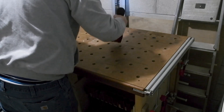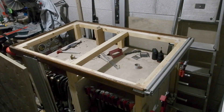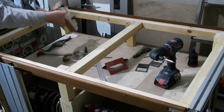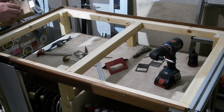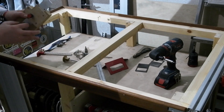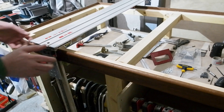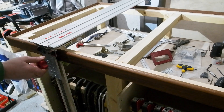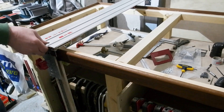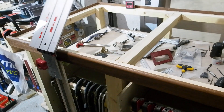Moving on — good a time as any to whip the top off. Then I can remove the front pin assembly to receive its own makeover. It was while considering my options for this that I discovered the perfect star knob for a height lock — this is a spare for my Woodpecker's feather boards. An M6 nut fixed to it and screwed into an already existing central M6 tapped hole. As it's turned it clamps down onto the steel linear rail, locking the assembly in place. Simple, minimal effort solution — and colour coded. Happy with that.